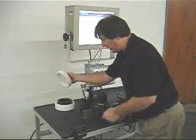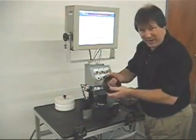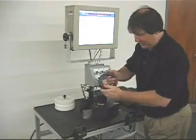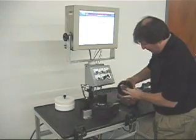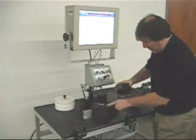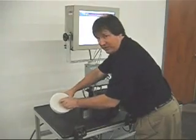This particular gauge also has masters. It has a mean master with a step in it so that you can just rotate it. You line the color up — red and green — to do the min and the max when you master. It's very easy to master.